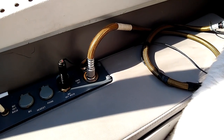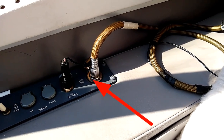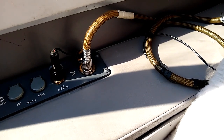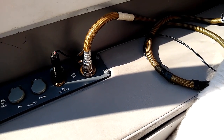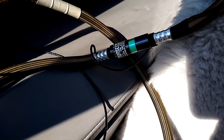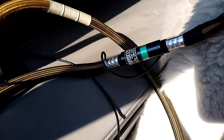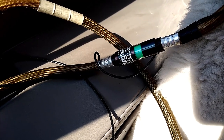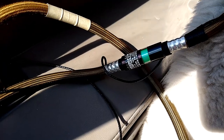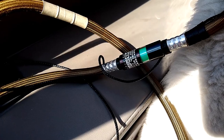We'll start with the oxygen mask on the co-pilot side. This is normally unplugged — we're out on a trip today so we have it plugged in, but normally when we put the plane away for the night we unplug it to minimize the chance of oxygen leaking out of the bottle. There's an inline indicator here that is orange or red when the oxygen mask is unplugged, spring-loaded to the orange position, and it turns green as soon as oxygen pressure is in the line. Once the line is hooked up, make sure that indicator has turned green.